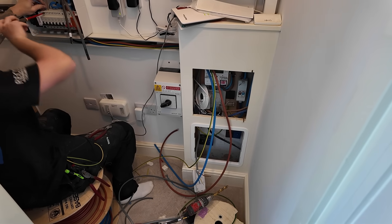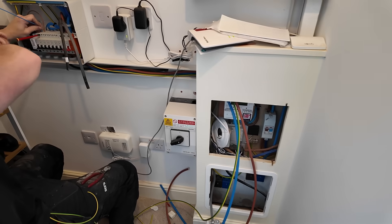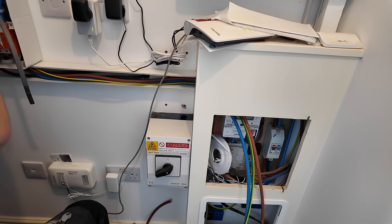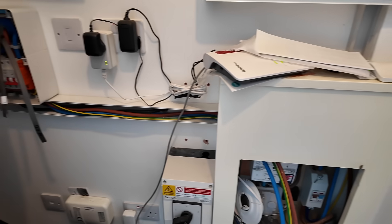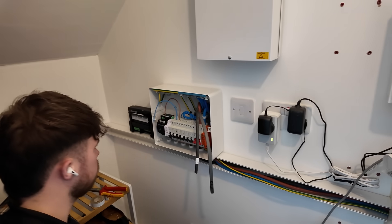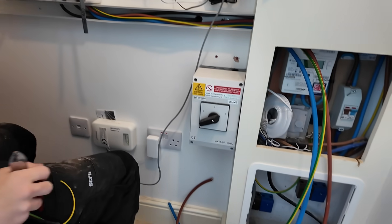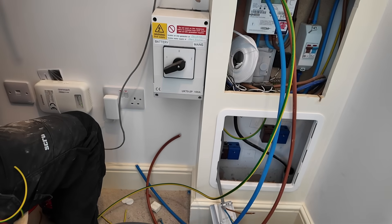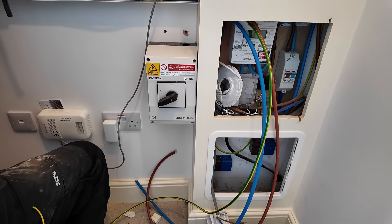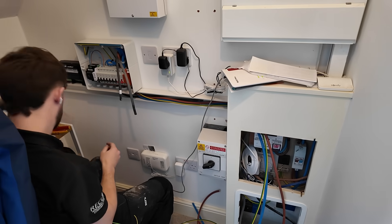Status update at about 11am on day two. Joshua is doing the electrical work under the stairs. The original box connected to the Give Energy system has been removed, extra trunking has gone in going over to the new central solar hub box, and the Enphase box has gone in at the side. Underneath the changeover switch for the EPS, a separate box is being added for the EV charger, as it was tripping one of the RCDs - separating it out into its own box should solve that problem.